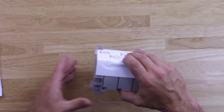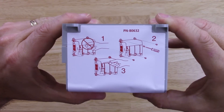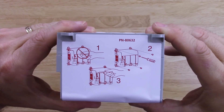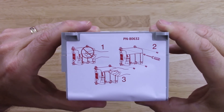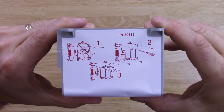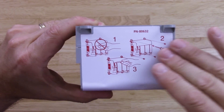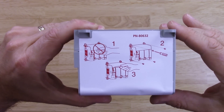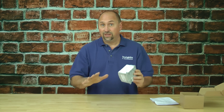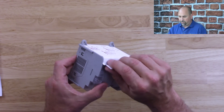I'll put that to one side. Here we have the unit — let's go ahead and pull that off and put the box to one side too. What they're showing you in this picture is that they do not want you to remove this protective cover until you've done all the wiring and drilling above this unit. In other words, they do not want any filings or wire strands to fall into the unit through the ventilation. That's very important — you can fry the unit very quickly if you let metal flakes float down inside it. This applies to all PLCs that have vents: never let anything conductive get in there because it's going to short out the circuits. So let's go ahead and pull ours off.